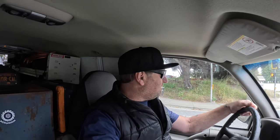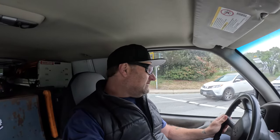On these ones, I usually just recover the gas to get in there because I've had terrible luck over my career with pinch-off tools. So I don't even bother. I've said that before in previous videos. When I do the Manitowoc fan cycling switches, I don't mess around with the pinch-off tool. The units hold such little gas, you can just recover it real quick. So I just break out the recovery and recover the gas. So let's get out there and I'll bring you guys along.